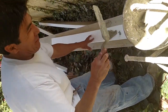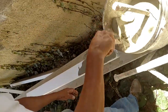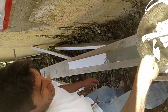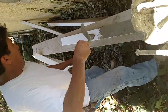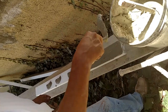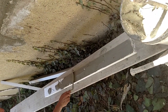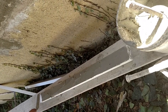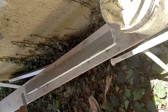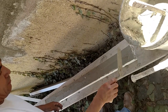The mud is a little loose — we like it a little looser rather than stiffer so it bonds to the wall, kind of like the consistency of pancake mix. He's going to spread it on and try to lay it nice and even. You want the thick part in the middle with a little hump, so when you push it up against the wall it flattens out. If you leave big chunks on the outside and don't smooth it toward the middle, it's going to drip off the edge and you won't get as good a bond.